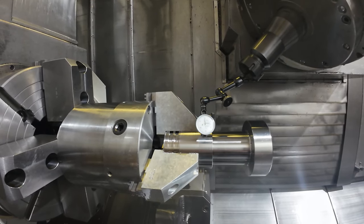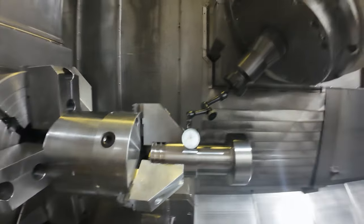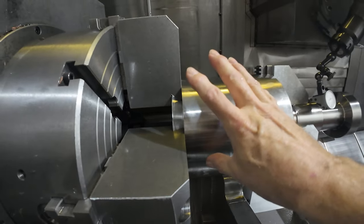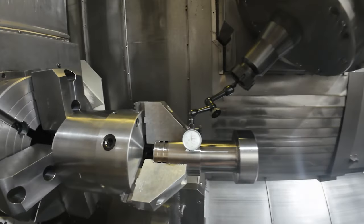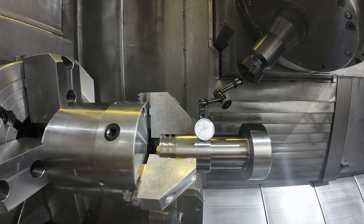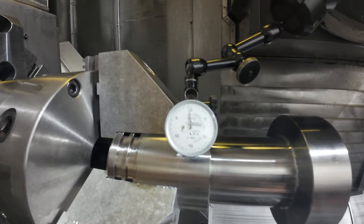That's the reason I mount this smaller chuck in the bigger chuck. I have a dovetail connection on here which is very strong — this doesn't move or go anywhere when you're machining. I've discussed that in previous videos on this dovetail connection on my channel.